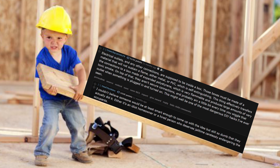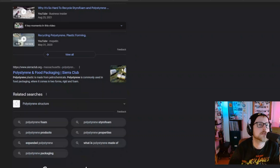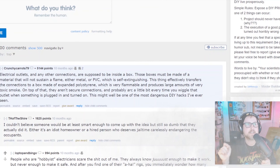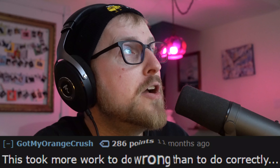This thing effectively transfers the connections to a box made of expanded polystyrene, which is very flammable and produces large amounts of very toxic smoke. That would go well with the coffee-stained wall lady — just put smoke on top of it. On top of that, they aren't secure connections and probably arc a little bit every time you wiggle that outlet when something is plugged in and turned on.